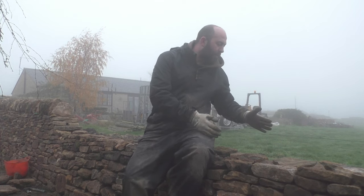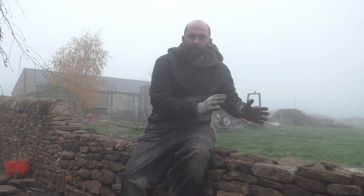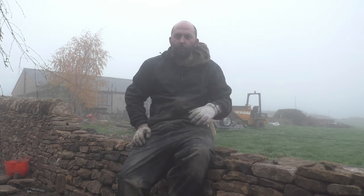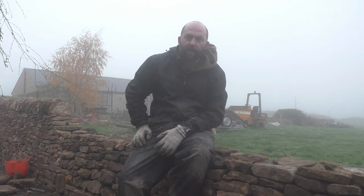So at this point, it's probably about 13, 14 inches wide. It'll finish about 12 inches. So I like to get a couple more through stones in here and there where I can, just adding that extra little bit of bond in the wall as it all settles together like we spoke about before. As it sinks in over the next couple of years, it'll really tie together.